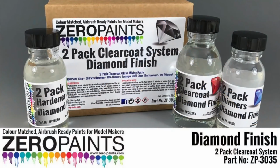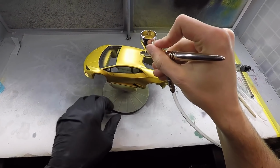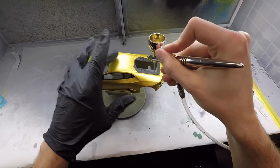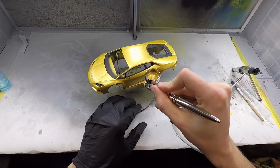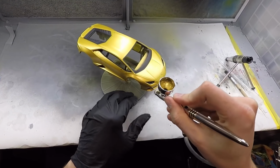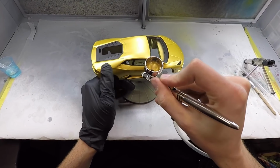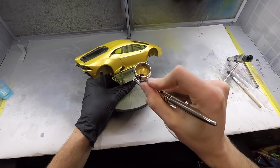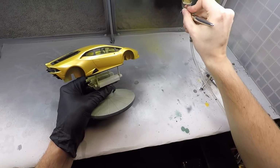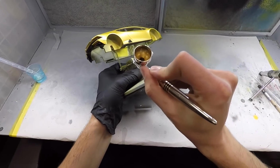After applying a couple more coats of black paint and a lot more masking tape onto the body, everything was peeled off, dried, and moved back into the spray booth to give it a nice glossy finish. Now, of course, I did touch and handle the body a lot, so there might be some dust on it, and as always, I just go over it really carefully by blowing on some air and removing that loose dust before I go on to those hard to reach, easy to forget spots and the entire rest of the body as well.